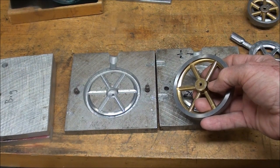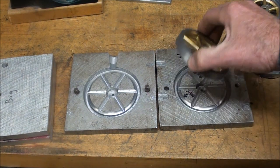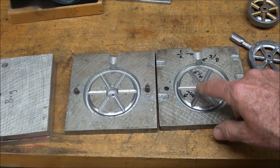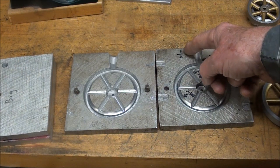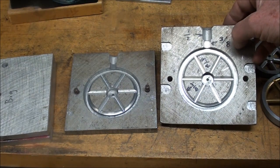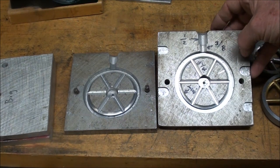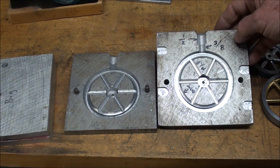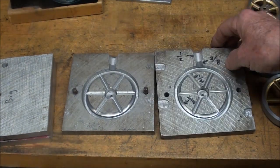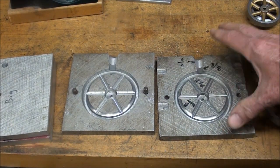This is the larger of the two molds, made of half-inch thick aluminum. These were made on the rotary table you might have seen in some of my other videos. On this one I had no provision for casting the center hole — there are my original dimensions in magic marker from when I had it on the milling machine. I'm surprised those didn't burn off. These little slots here are made for putting a screwdriver in to pry the two halves apart, because sometimes it's kind of tricky.